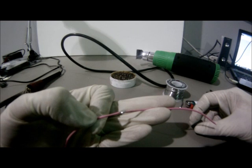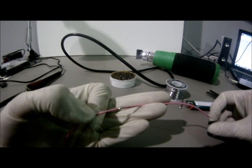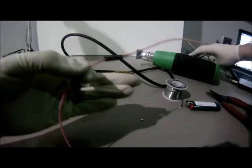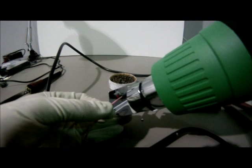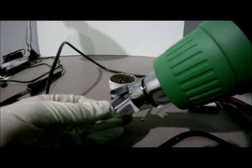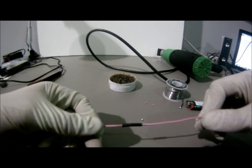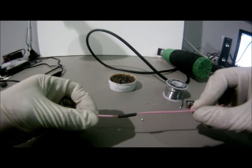In this example, I will now show you how to use the heat gun to apply the heat shrink tubing. As before, cut roughly three quarters of an inch of heat shrink tubing and slide over the solder location. The heat gun should have a shield on the back to ensure that the heat shrink tubing is applied evenly.